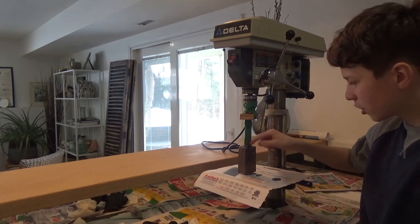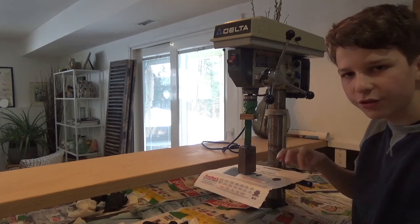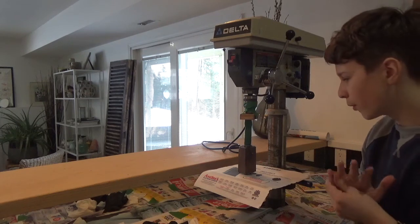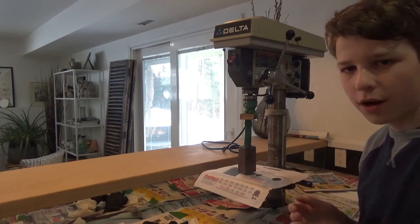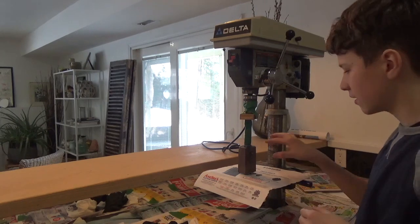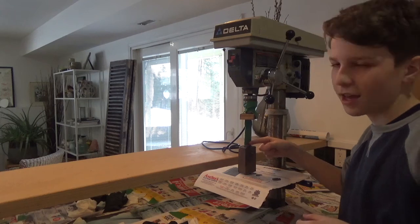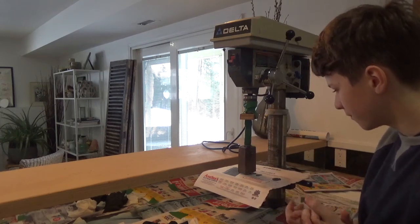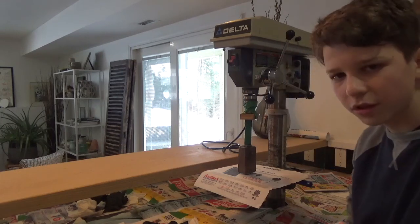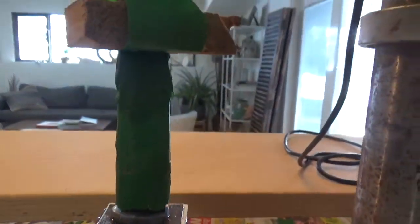So you want to make sure at the top bolster here that you clean it off, all in the crack in between the blade and the bolster. Get as much epoxy off as you can, because once this is all together, it's going to be pretty hard to sand in there. So yeah, looks good though.